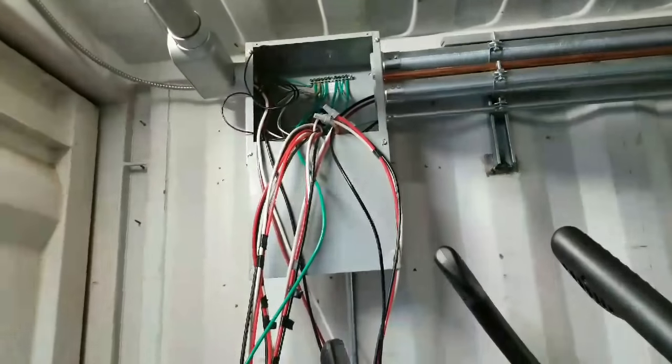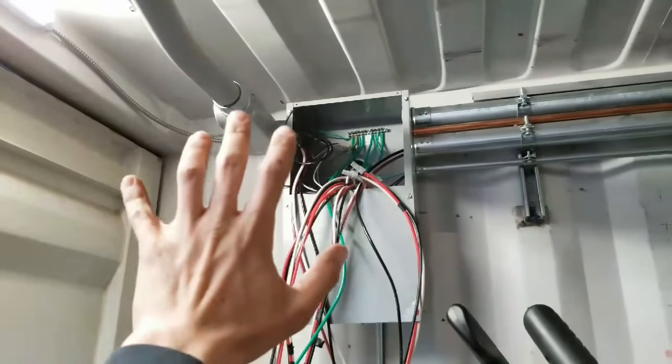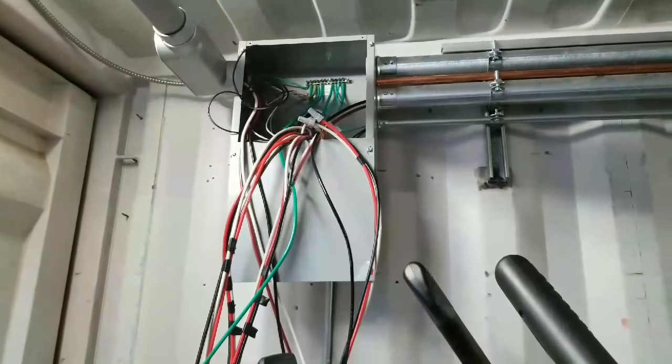Today I am in the electrical room. This is pretty much day 2, and I'm working right now on getting these conduits done. I've pulled all the wire that was in there out. I have them ready to go. I landed a ground bar in that can. That way all the grounds can be connected there, and I only need one number 6 ground running back to the panel. So what I'm gonna do is, now that this is all pulled out, minus this bunch right here of circuits, I'll pull that out here in a minute.